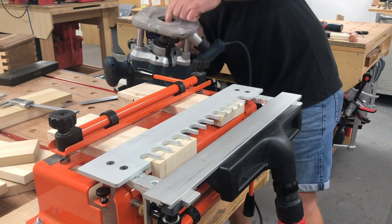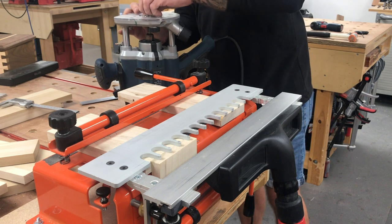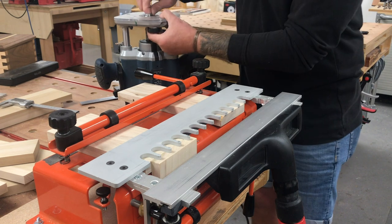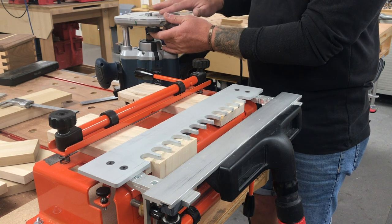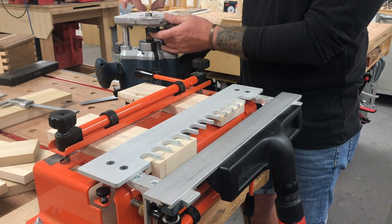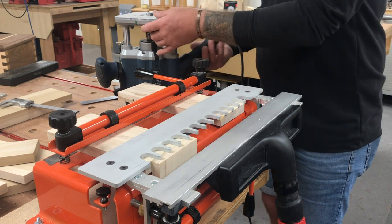There's a little lever. There we go. So that's fitted. No screws, no nuts and bolts to do up. That is fitted in position. The adapter and the bush in this point must remain flush or beneath the level of the base, with just the actual template ring, the guide bush ring rather, to run on your template. Okay, so that's fitted in.